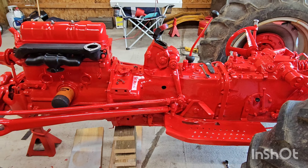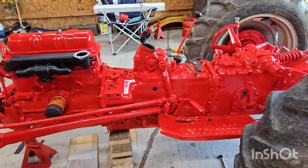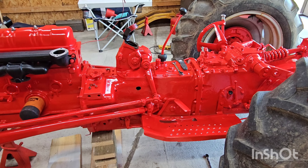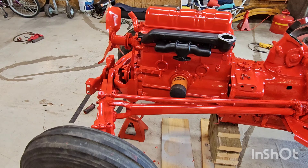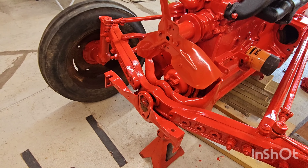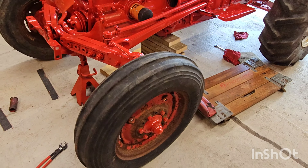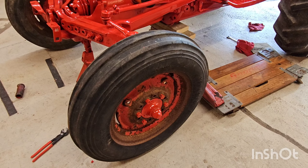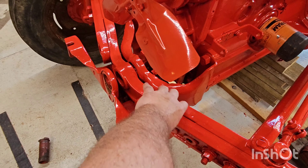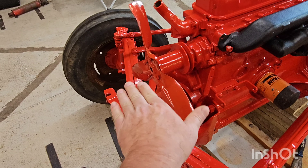The problem is I've ran into more issues and more issues and more issues. The tractor ran great, but the guy who owned it definitely did some hillbilly engineering, and I'm happy to right those wrongs. Problem number one is this pivot pin up here. When I jacked the front end up to get the tires and wheels off — I am going to be redoing the tires and wheels — I noticed that the front axle right here was literally teetering back and forth. I know they're supposed to pivot one way, but it was teetering the wrong way.